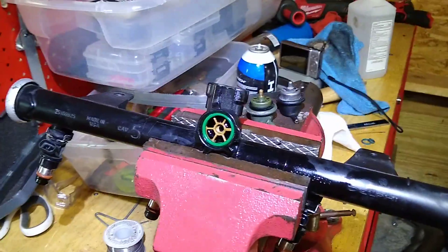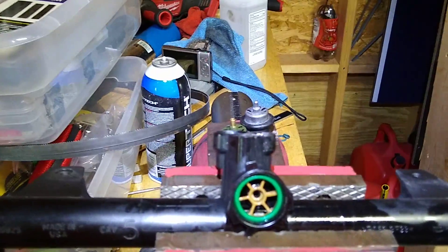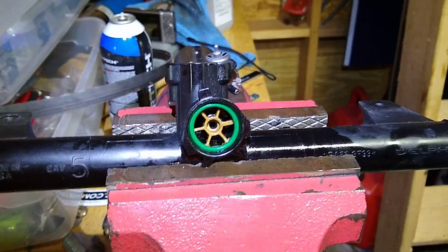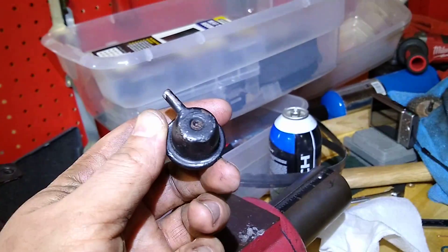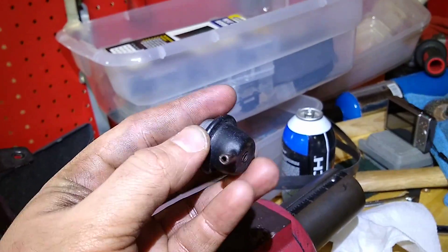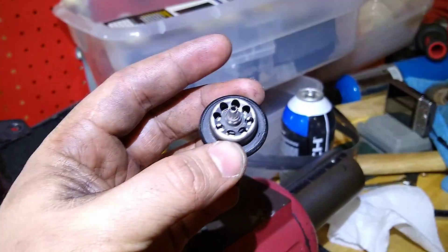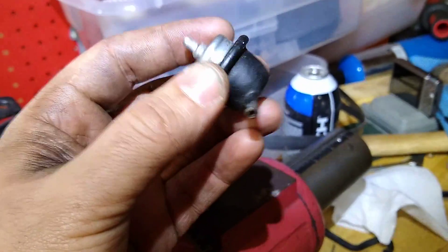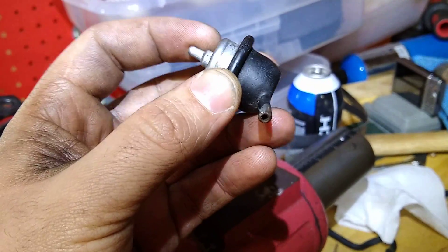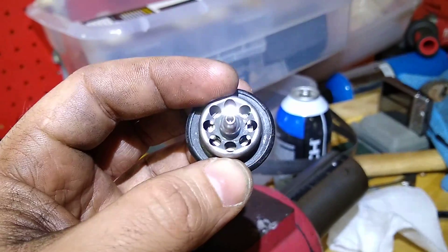This is just a quick video to show Matt from Sloppy Mechanics the differences between fuel pressure regulators — ported and non-ported. This is a stock regulator, all I did was paint it, but it was having some overrun issues with the Walbro 525. It's getting somewhere around 65 pounds of pressure with this, so I decided it needed to be ported, but I didn't trust how thin those walls were.